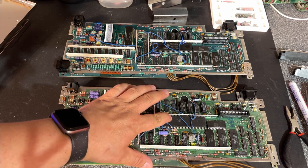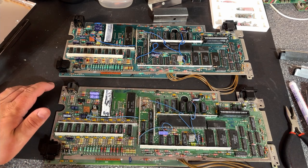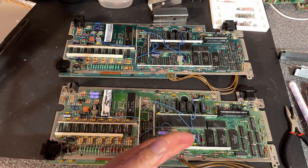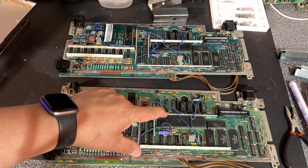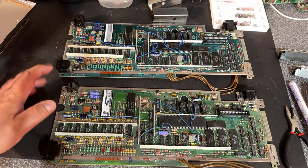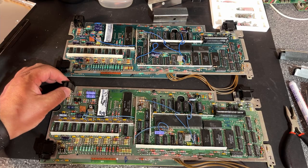Even though the CPU is a 16-bit CPU, it can only address 8 bits of RAM at a time, and that's a little bit strange design. It has like a 16-bit side and an 8-bit side, and everything between needs to go through some complex logic. The CPU actually has its own small 256 bytes RAM that it can use, but everything else goes on the data bus as 8-bit. And the sound and the video chips on these machines are also Texas Instruments custom chips.